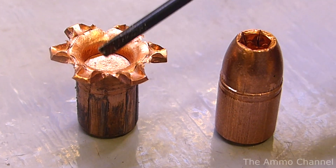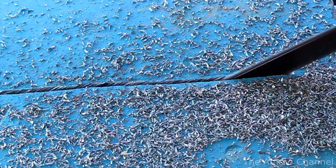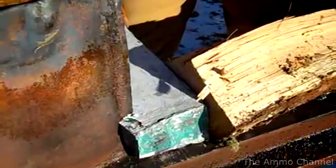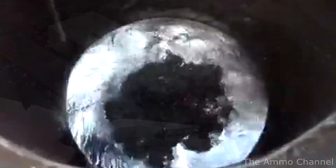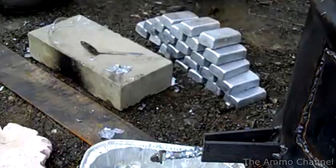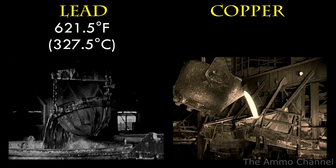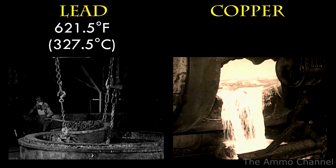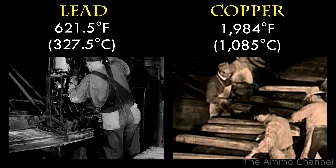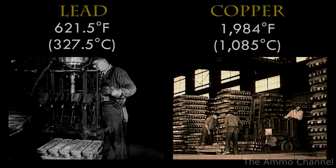In general, I would consider copper to be a soft metal, except when it comes to bullets where lead has long since been the material of choice, and with good reason. Lead's ultra-soft properties allow it to deform easily, and it's also easily melted and cast to whatever shape we need, even over a campfire — it's just easy to work with. If we compare the melting points: lead melts at a measly 621 degrees Fahrenheit — that's 327 degrees Celsius — compared to copper, which melts at a formidable 1,984 degrees Fahrenheit, almost 2,000 degrees, just over 1,000 degrees Celsius. So we have 600 degrees versus 2,000 degrees.